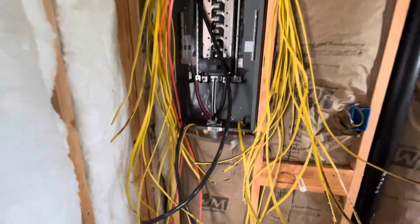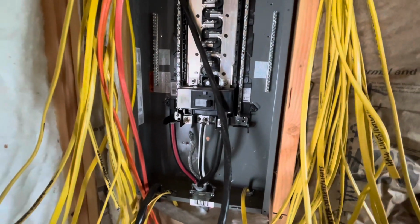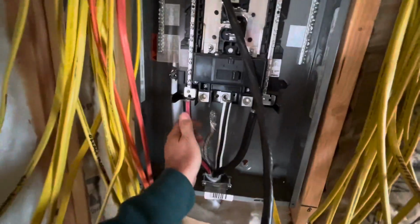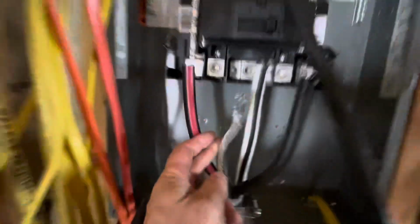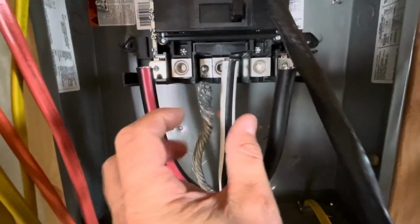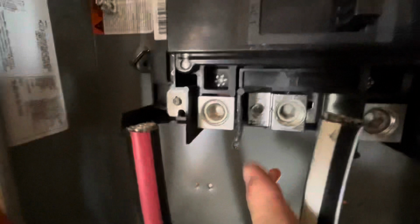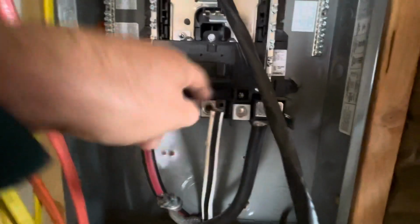All right, I think I'm gonna attack this breaker panel finally. I had cut these off and then panicked when I cut this with the Sawzall, and it frayed just enough, like it just flexed out these wires just enough that I could never crimp them enough to get into that slot there. It's a tighter lug than these big ones.